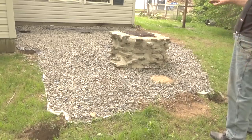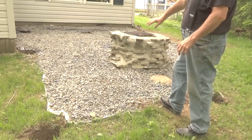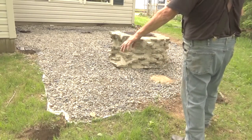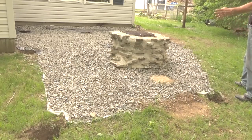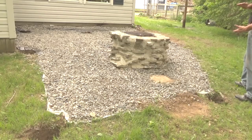Just to give you an idea of what's going on here — that up there is fairly flat, but it runs downhill very, very hard here. So the deck is going to be maybe about a foot and a half or so off the ground where the holes are. You can see the holes here. Because of the curvature of the ground, this doesn't look straight, but it's straight from that post hole to this post hole. At the bottom of the hole is concrete — about 8 inches of concrete to hold up the deck at the bottom of a good solid hole.